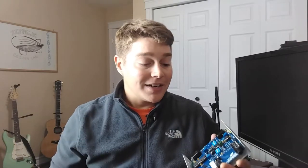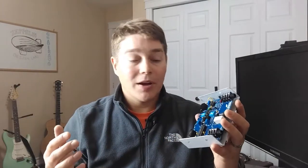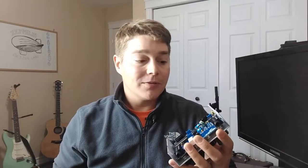So, stupid mistakes time. Obviously, I'm just as prone to making mistakes as anybody else, and I like letting you guys know where I went wrong so maybe you can avoid it. There wasn't too much crazy stuff going on here. One of my mistakes was just a simple swap of capacitors. I wasn't reading the document and I was trying to put it together too fast, and I ended up putting a capacitor in the wrong spot. So I had to do a quick desolder and flip capacitors, but that was my first mistake.